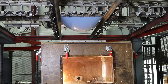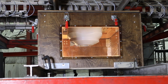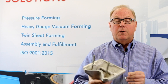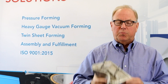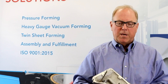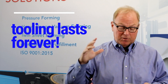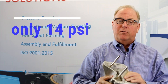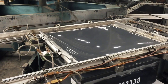If you have a high-porosity casting, the porosity reaches the surface and you get imperfections. We battle this all the time — people ask why our tools are 20 to 30 percent more money than the other guys, and claim ceramic or urethane tools work just as well. Plain and simply, it's all false — smoke and mirrors. You want a repeatable part, able to make parts every two minutes the same way now and five years from now, off the same tool that will last forever because there's very low stress — only 14 PSI if vacuum formed, and at most 90 PSI if pressure forming, not thousands of PSI like in injection molding.